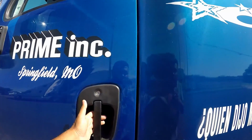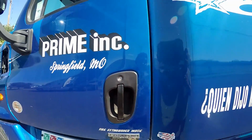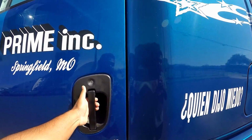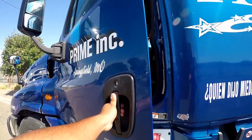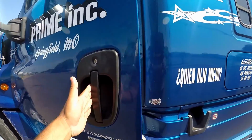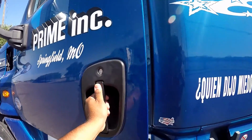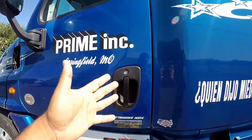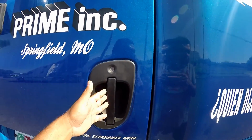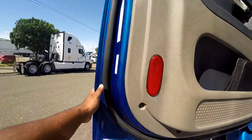And when you talk about the door, you're going to talk about the door and hinges, along with the seal and the door latch. But you're going to first start off by saying, I'm going to look at my door, make sure it's properly mounted and secured, not cracked, bent, or broken. You want to open it, and then as you close it, you want to talk about the door latch. Make sure my door latch opens and closes properly. At that point, you have already demonstrated to the examiner that the door latch opens and closes properly. After that, you proceed to talk about the seal.